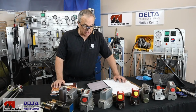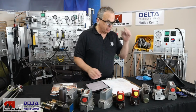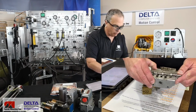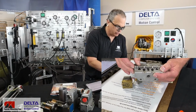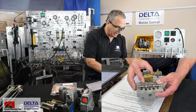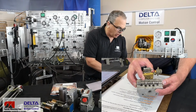Carl Carey is asking whether that wire that's connected to the spool is used to center the spool. Yeah, well, that's part of it, right? It's part of a larger feedback scenario at work in here to make sure that our spool doesn't travel too far, that a proportional amount of pressure change on one end of the spool or the other doesn't end up driving us hard over.